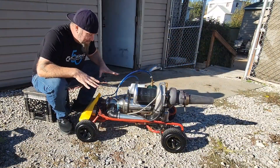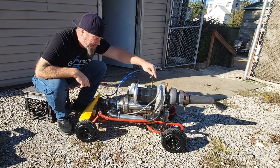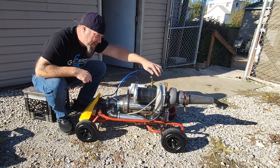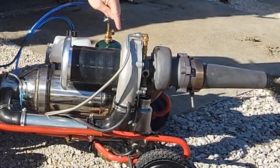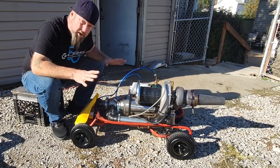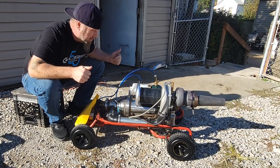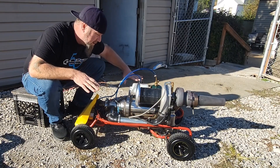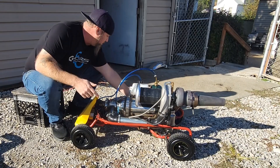All set up outside. What happened is I was able to trade for a bigger turbo. The original one I had was different AR sizes — this new one is smaller on the hot side, bigger on the cold side. More incoming air, but it'll still spin the turbine well, hopefully. That short fire really seemed like it wanted to go. I'm running an old bottle of propane so I'm not giving it as much propane, plus a little bit of jet fuel — kerosene. I think we're good.